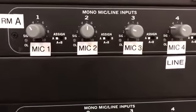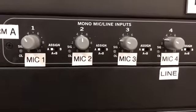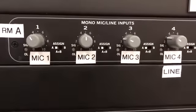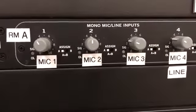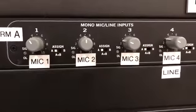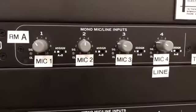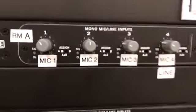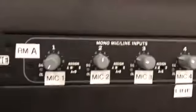If you're using a wired microphone, it should be plugged into the wall plate on input 1. If the microphone and cables are in good working condition but you're still not hearing anything, come back and look at the room mixer you're plugged into. If you have no audio, that channel is off.